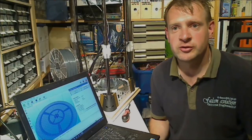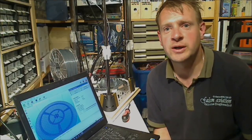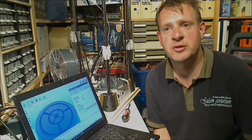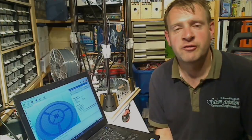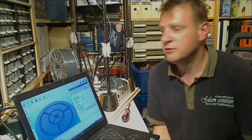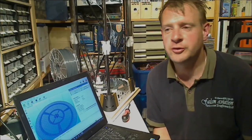The default firmware that I downloaded had settings for the extruder that were way too high. The steps per millimeter setting for the extruder motor was around 700 steps per millimeter, which is severely over extruding, which obviously resulted in skipping steps on the stepper motor. I got it dialed down to 180, so 180, and now it doesn't click anymore. It sounds pretty good actually. It puts out a decent amount of filament, so yeah, that looks pretty good.